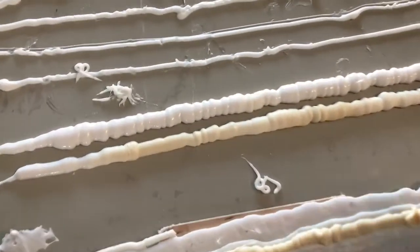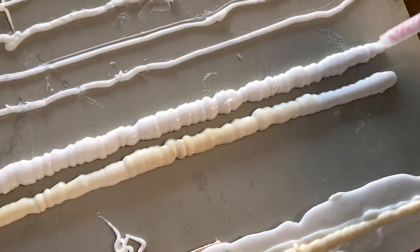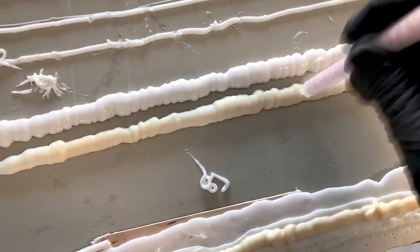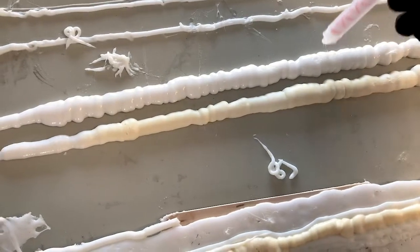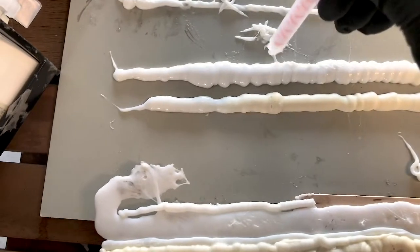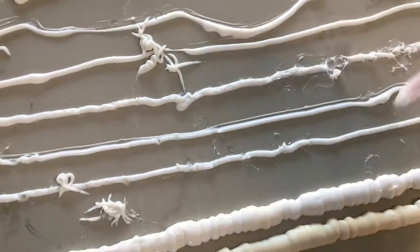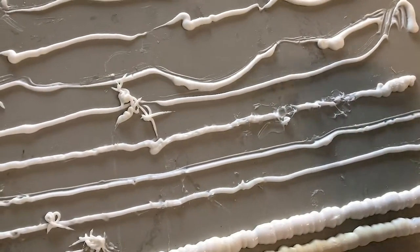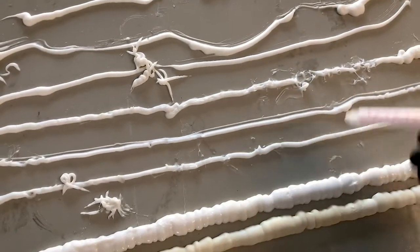And by the way, liquid at the beginning, and this was the second bead, and that is rock hard and very hot. Rubbery in the middle, hard, rubbery, liquid, and back to the bead that we did second with a partially blocked nozzle. This is coming up close to an hour now. That is still 100% liquid.